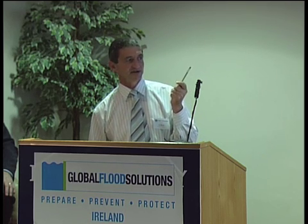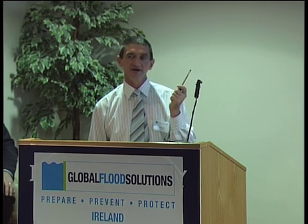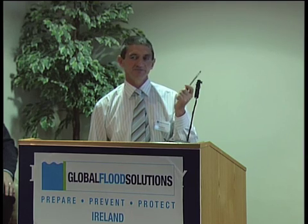The sand in the system can be recycled by virtue of the fact that the polypropylene compound on the water side of the bag renders that side impervious, so that pollutants in the floodwater do not come into contact with the sand. In contrast, sand used in sandbags, in the event of contaminants being present, will be contaminated and will have to be disposed of by necessity.